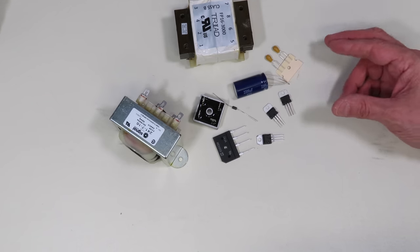The other chassis is a longer one with ventilation holes in the top. Because of its height, I cannot put the larger transformer in — it's just a bit too tall. So I'm going to use the low-profile transformer and put it in the longer chassis. This one needs to be mounted on a printed circuit board or in my case a perfboard. The advantage of this chassis is that it's larger and I'll be able to put more things on it.